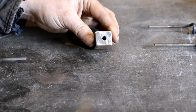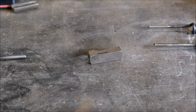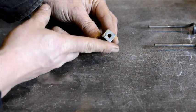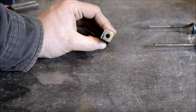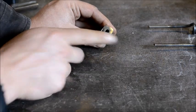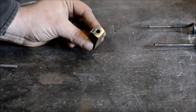We're going to be making a square set-down tool, or roughly a rectangular set-down tool. And then we're going to be taking this little tool here, which just happens to be five-eighths square stock by the width of my power hammer dies, and we are actually going to cut it on the diagonal to create what I call a butcher tool. It's not really to cut material off per se, but to help separate stock. I'll go over that in more detail when we actually go to making tongs on the power hammer — you'll see what I mean by it dividing up the stock for the boss area and the jaw area.